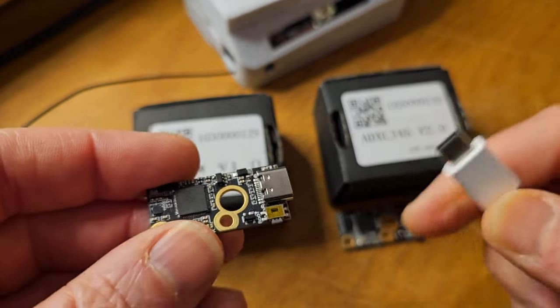Now that's all done. As you can see, it printed out a whole bunch of different options — all the different smoothing styles and the different frequencies that go along with them. So for example, if you're going to choose to use the EI shaping style, then you'll want to set it to that specific frequency. It's also showing the maximum acceleration to avoid too much smoothing, where corners start getting really rounded and lose their sharpness.